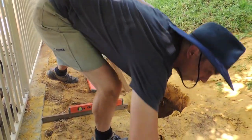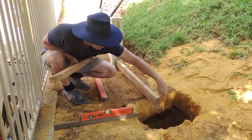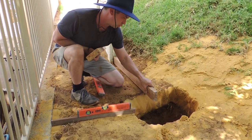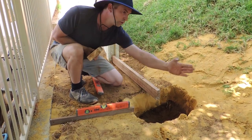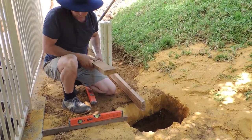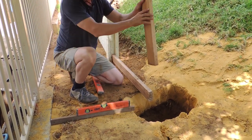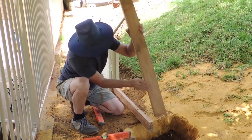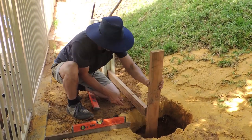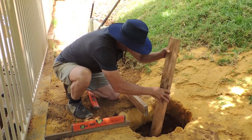It's spirit level / bubble level to there, so we know that's right — this is our post-length piece. You can see it just creates the central point of the hole. I know it should cap in there, and because I want to curve this off into the wall that way, I'm thinking about positioning it there. I've got it level to the top of the wall, bubble level, so I know that's the right height. I've got my 300 mark there and I've dug the hole down so it's about an inch below that marker point — we're basically now ready to drop the post in.